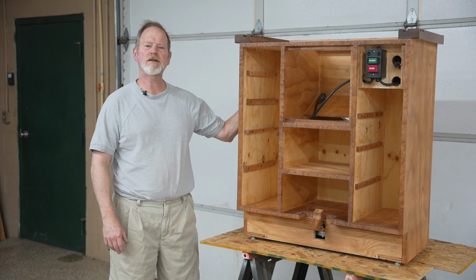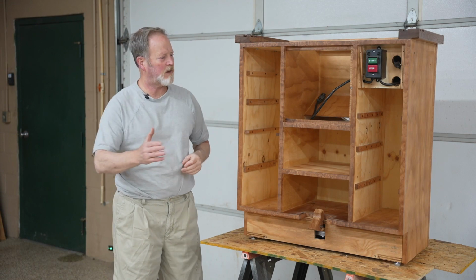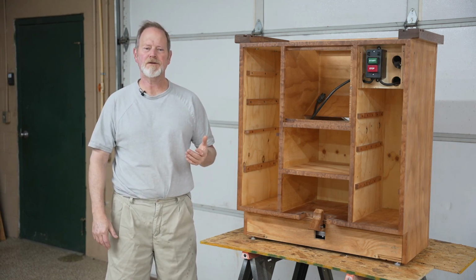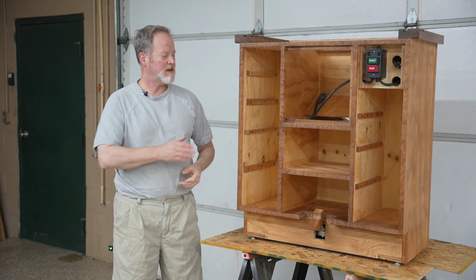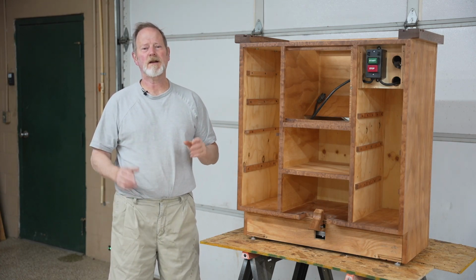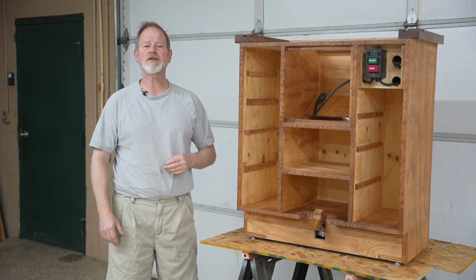I'll do the sides, the back, and all exposed faces. I'm not going inside the cabinet. It's sealed. I don't have to worry about differential moisture. We'll probably go back with a third coat on surfaces such as these that get a lot of wear, especially these rubs up front, and probably the drawer fronts because I kind of want a little bit more sheen on those, and those will get touched and those will get bumped.